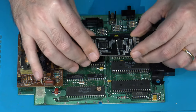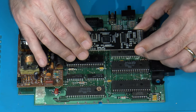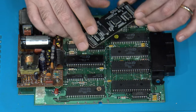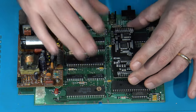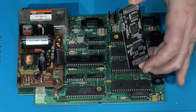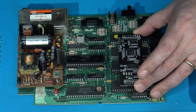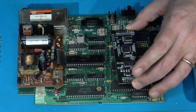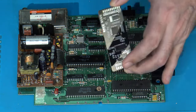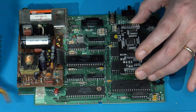The RGB board itself is fairly large. Like other installations, you want it oriented so your inputs have as short a run as possible and your outputs fit logically. It is technically possible to set this board on top of some of the IC chips, but I'm not a fan of that. In this installation, two IC chips are in sockets and two are not — I'd only be able to affix it to the socketed ones at maximum height, which may cause a clearance issue with the top cover. Additionally, these chips get hot — not as hot as on the Model 1, but they still get hot. The board is really designed to be installed from the other side.